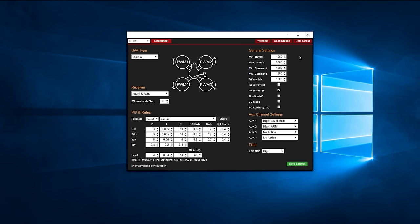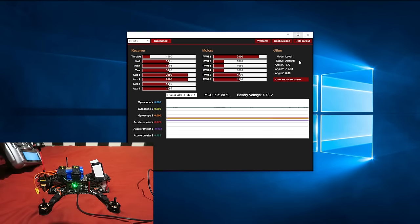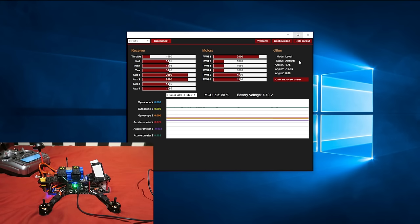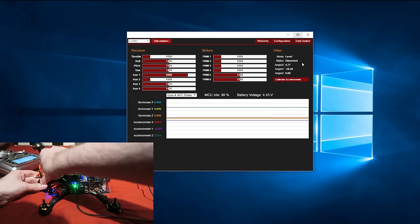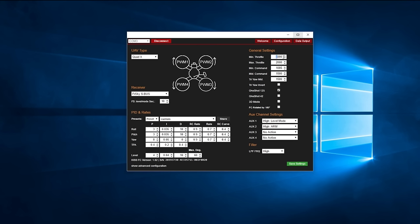Set the max PWM value to 2000, which is recognized as the maximum throttle, and then save the settings. You then need to arm the board using the arming switch. Then plug in the flight battery, which sends a 100% PWM value to the ESCs, and the ESCs then recognize that they are in calibration mode. Hit the disarm switch on the Taranis, which tells the ESCs that we are at the minimum throttle. The ESCs are then calibrated. You then need to set your minimum throttle back to 1080 or whatever preference you had and save the settings again. It's not super simple, I think you will agree.